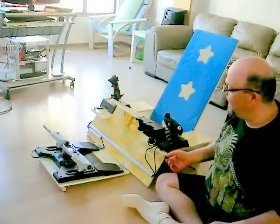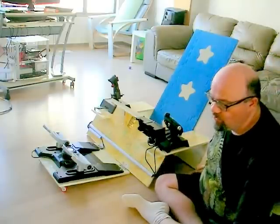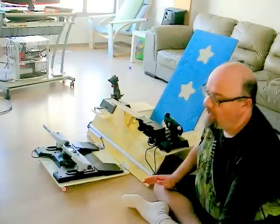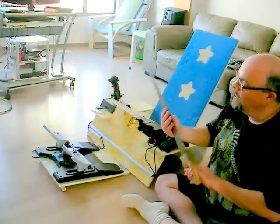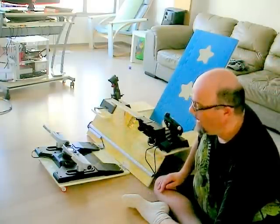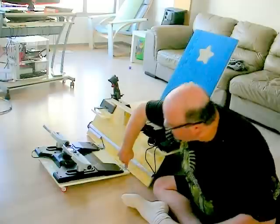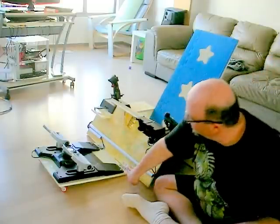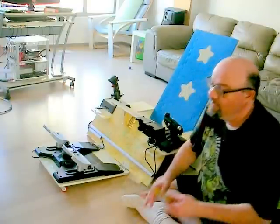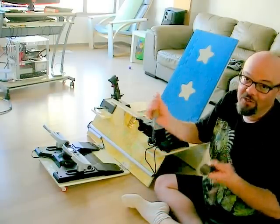The tools I used — I just want you to know that no power tools of any kind were used in the construction. I used a handsaw — a 20-inch handsaw. I got a very nice sharp blade and also a thin blade, which came in very handy. For the hinges, I had to do what are called mortises, where you chisel out the wood in order to make room for the hinge. For that I used a utility knife, a one-inch chisel, and since I couldn't find my hammer, I just used a spike for tapping it out.